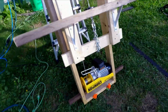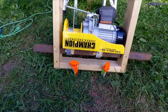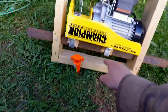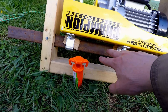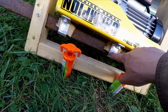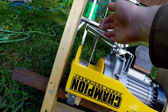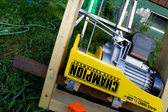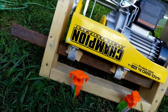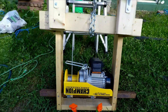It works flawlessly — it doesn't have any issue with the weight. I did put stakes in the ground just to make sure it doesn't slide back. The only thing with the square tubing is that the cable from the hoist, if it was tilted a little bit, would run on the safety hook. So I just put some pine shims I had laying around in there just to take up that slack.